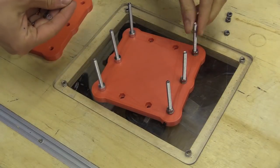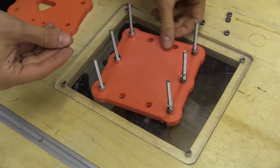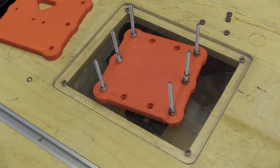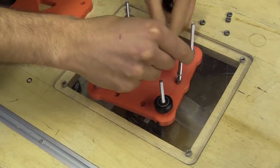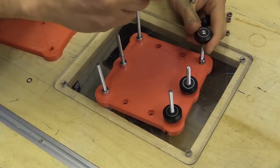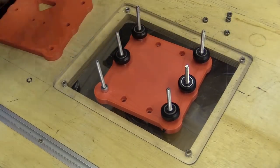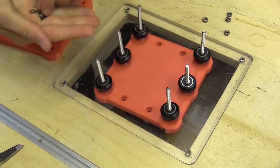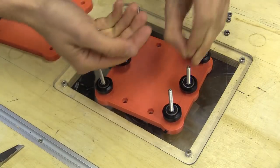So while I put the gantry assembly together I'm going to verbally explain the parts and positionings. The top line of wheels uses eccentric spacers while the bottom ones are fixed. I happen to have quarter inch ones but you can get and use 6mm. The spacing is very simple: it is a fixed spacer or eccentric spacer, then a precision shim, then a V-wheel.